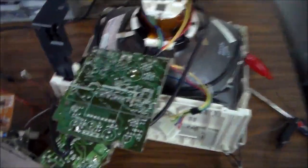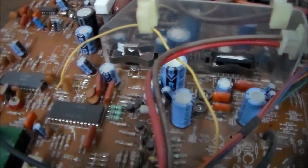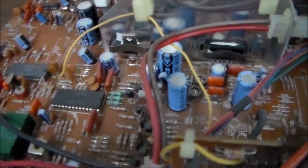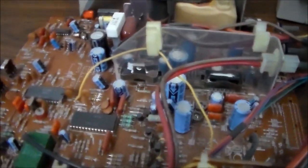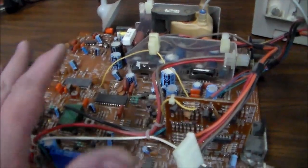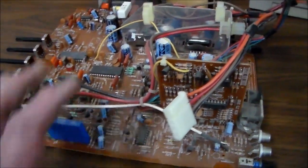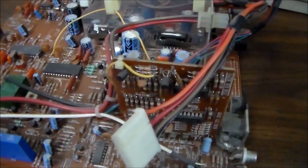We've brought this back to the workbench. This is the power supply — this board was mounted in here and it's got a few caps on it. The huge ones usually you don't have to replace. This is the main board, and all of these blue caps need to be replaced — they're just old. These are electrolytic caps and they have a fluid in them. After many, many years that dries out and changes the way the cap works, so it's not doing what it's supposed to do. The way you fix it is take the old one out, throw it in the trash, put a brand new one in. That gets all your voltages back exactly how they should be.